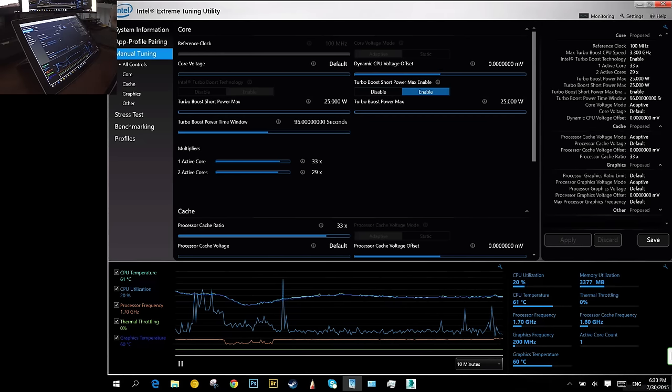And you want to start off, I'd say, with like 20 or 30 millivolts and then just keep playing with it. And only do one setting at a time. Don't go through and change them all, because if you do have a problem, it's going to be very difficult to know which it is. And I would really start from the top of these and work your way down.